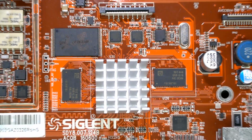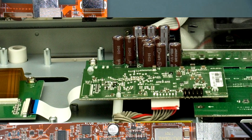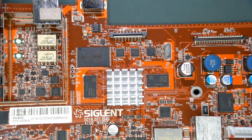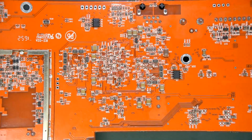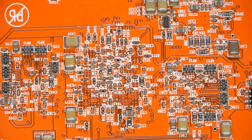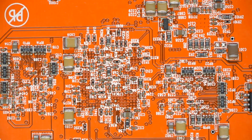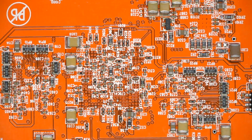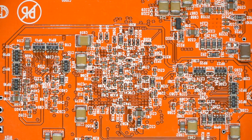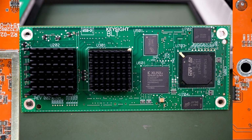And the interesting thing is that it is on the main board, whereas we saw it on a daughter board, just the processor part on a daughter board inside the GW Instek, and that was to lower the cost, because you need to fan out this BGA, you need a big multi-pin multi-layer board. There's all the bypass caps and everything else. They've fanned out almost every via on the thing by the looks of it, and to get that out you need like an 8-layer board or something, minimum. And we've also seen that daughter board approach in the new Keysight 1000X series as well. Once again, to get the cost down, keep all that multi-layer complexity on a smaller board.